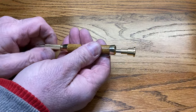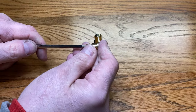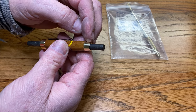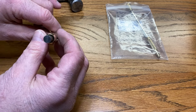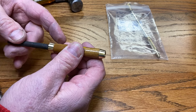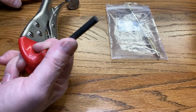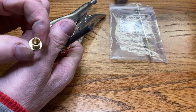First step in disassembly is to unthread the nib. Grab a hold of the housing there, pull that out, and slide that back in. Now I'm going to go get a couple of punches and we'll begin removing the components from the blank. This one could be a little tricky to disassemble because normally your nib will come down to a cone and you can get a punch that goes through the back of your pen and presses against the inside of that nib to knock it out. But on this particular pen, the diameter of the hole inside is the same on both ends. So I'm going to have to hold it at a bit of an angle and work from side to side to see if I can force this out without damaging it. I'm pushing my thumb against it to hold it to the front — a couple of taps — then I'll put it the other direction. There it is. We got it. And if we look, we did not do any damage.